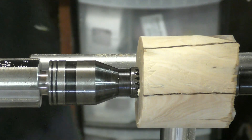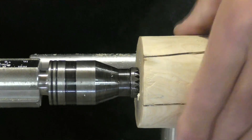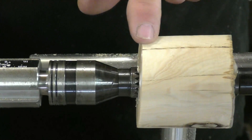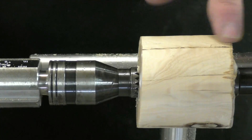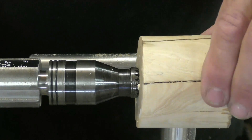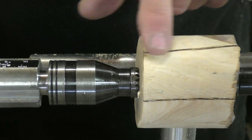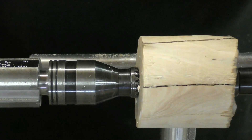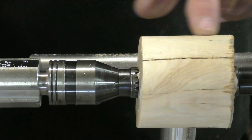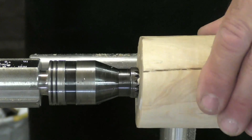For me this is the test I'm most interested in. Here we've got a piece of yew, which is notorious for having cracks in it. I'm going to fill one with my usual thin CA - the O3 thin CA mixed with coffee grounds. And on the larger crack I'm going to use neat black thick CA. I'm going to let it cure properly like I would normally, and we'll see what sort of surface we get when we sand it and put a wax coat on.